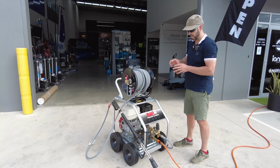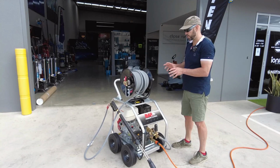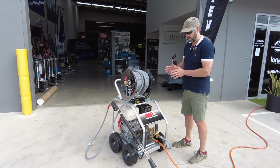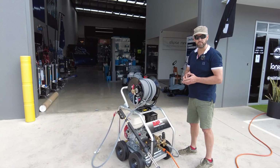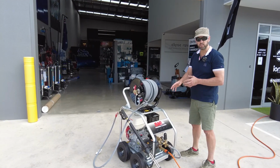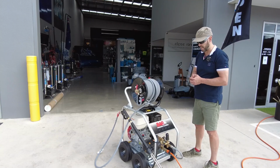The previous video we did a comparison of the 3 best-selling portable pressure systems that we do here in Australia, and I wanted to talk about this industrial portable pressure cleaning system. Industrial means built to last. Low speed pump. In the previous video we talked about direct drive. On those direct drive units we've got an RPM of 3400 RPM at the pump. Having this reduction gearbox in this large Comet pump, we're only spinning this pump at 1450 RPM.